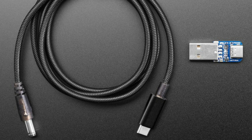Basically, it's extremely dangerous because you don't know what you're going to get, like if you thought that you programmed it for 9, but it's actually 12. This is a super fun cable. If you're interested in experimenting with power delivery, though, I think this does have some use cases, especially if you're not sure what power delivery you want or you want to test a power supply with different voltages. So it's kind of funky.